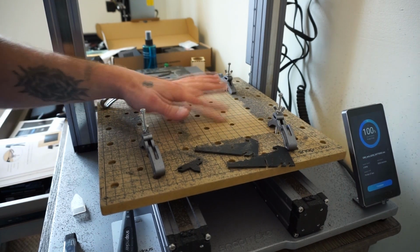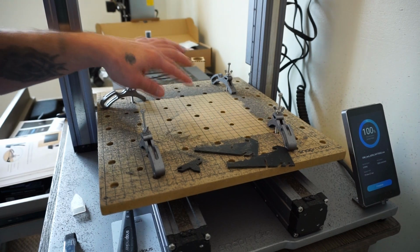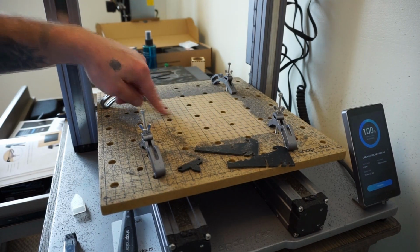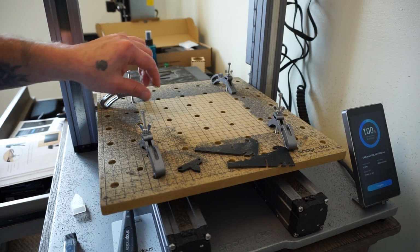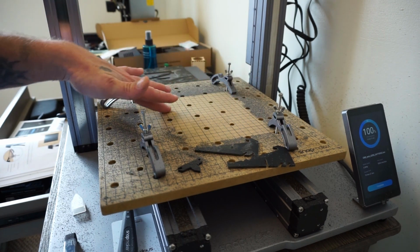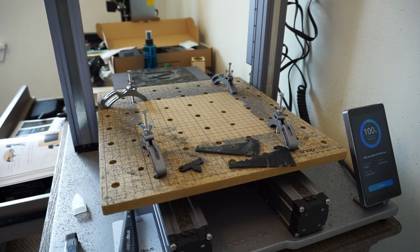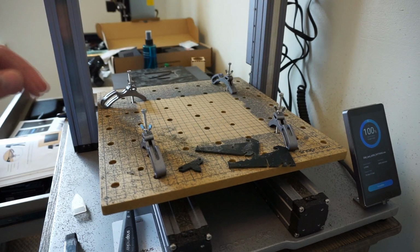There may be a minor bit of imperfection in the overall thickness of the board. I possibly may not have had a screw seated down entirely. You can see over here in the back left hand corner, high on the Y axis, I have no scratching at all whatsoever. It does go in more towards the high on the X, so here it tapers down and goes in. There is minimal carving into it. Like I said, I knew this was going to happen. That's not bad. I'm fine with that, but I am definitely going to work on, in the future at least, getting some spacers to go under the work piece between that and the work surface. That way I can eliminate the amount of damage to the work surface.